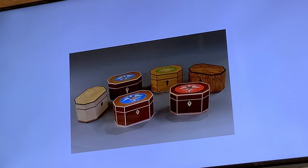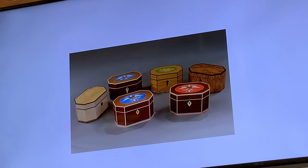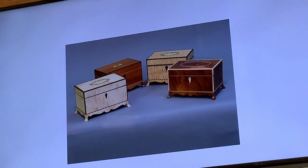Some of these are solid wood, some of them are veneered. On the veneered one, I would veneer all the wood first before cutting. Usually you have a vacuum press. I took a big board, stuck it in the vacuum press, and put some veneer on it. Then I had a poplar board with mahogany on it, and I can cut that up. I made all the little inlays on there. One of them's lacewood, and the other one's spalted maple, plain maple, mahogany, and cherry. I made those year before last for Christmas.